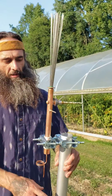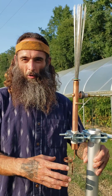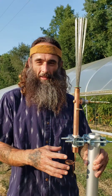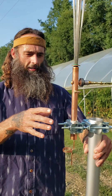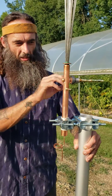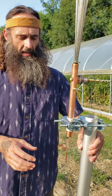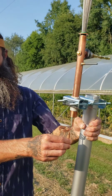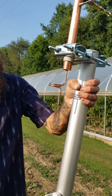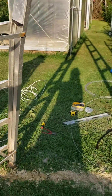With the mounting of the CW-1s or whatever model, there are other options. You can make a PVC sleeve that slides over and then just metal strap it or zip tie it to that PVC. However, this keeps the antenna off of the pole altogether. It gives you a lot of options when you position the rod to magnetic south and gives you some variance in positioning. As you can see, this lead wire will couple to the insulated wire, then run down through the ceramic insulators where it will meet the ground line that's stubbed out over there.